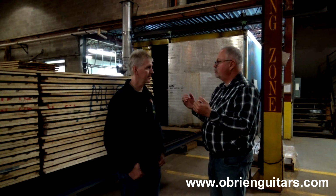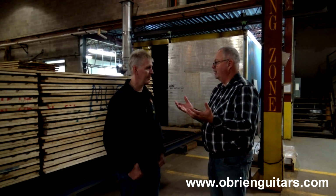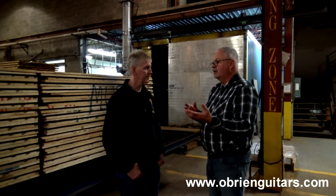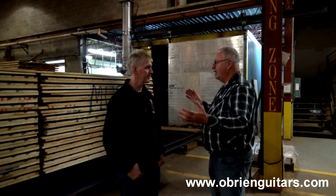The outside of the board won't give you any information. You look at it, it looks the same as it would any other time, but it's when you split it up. Different species of wood are harder to get the resin pockets out and get that moisture out, and would extend the period of time.